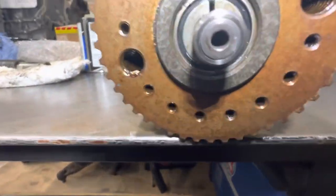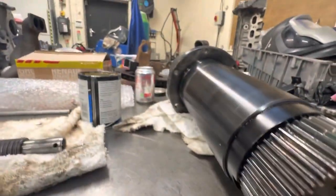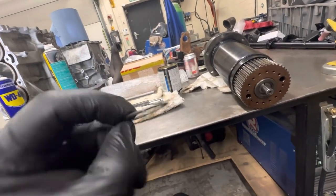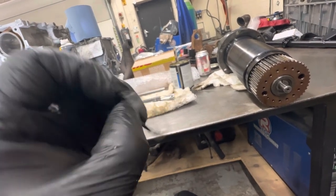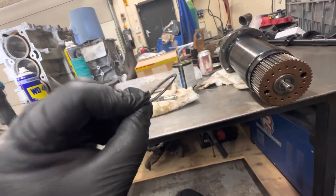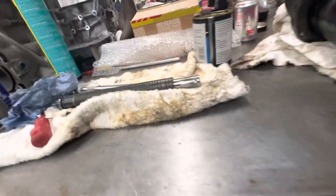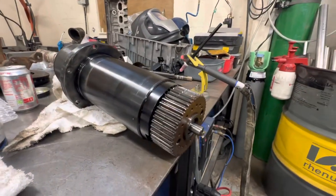That we've got the clip for the drawbar fitted back in there now. The clip that originally came off this one here, if you look how bent up it is, I think this wasn't actually sitting properly in the recess, hence why it's gone completely concave. Looks more like one of the Belleville washers. So yeah, we sacked that one off. Obviously that can be replaced when this drawbar is redone. So that's there. Time to get it back in the machine.